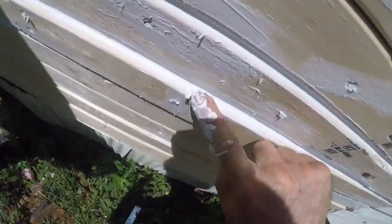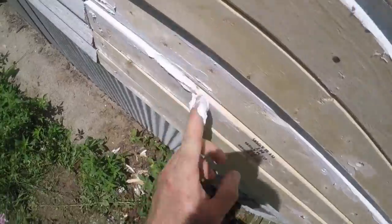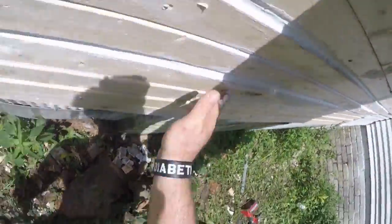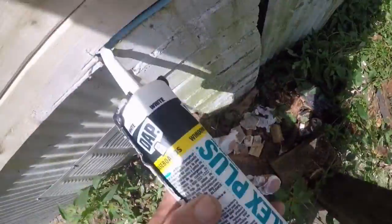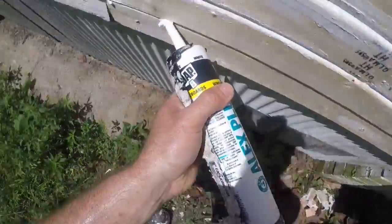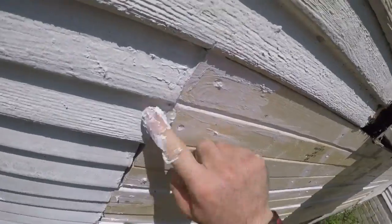I used 1x3s as my siding. You'll notice the siding already on the house is a little different. That's because it is a tongue and groove siding that measures 1x3 as well. I looked for this siding online, but as the house was built nearly 100 years ago from scrap wood at a lumber yard, I was unable to find any. Luckily, when painted, the 1x3s will blend in well. That is, after I fill in the transition from the original siding to the 1x3s with caulking.